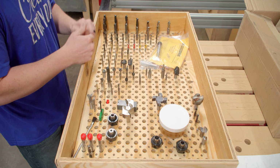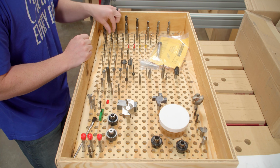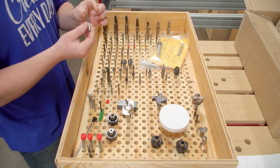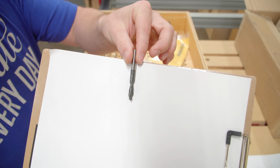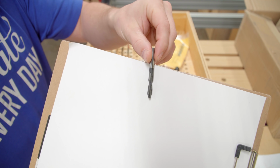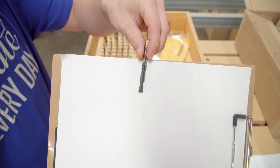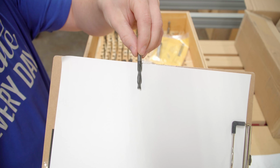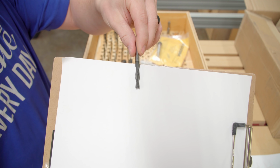Let's go down to a 1/4-inch. So probably the most used bit by far in my CNC machine is a 1/4-inch diameter downcut 2-flute spiral. So 1/4-inch diameter, we're not removing a lot of material. This is good for profiling, kind of slow for pocketing, but sometimes it's more beneficial to use a slower tool because you don't have a bit change.